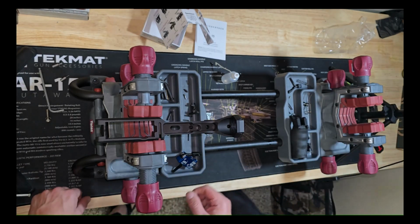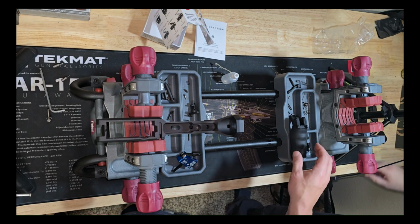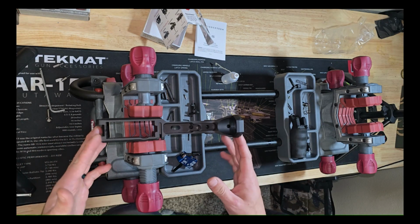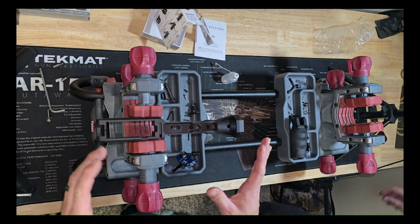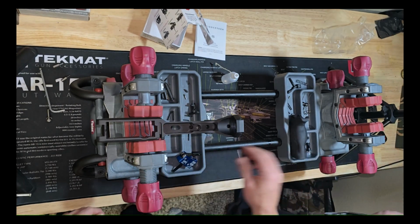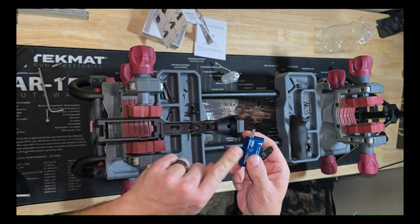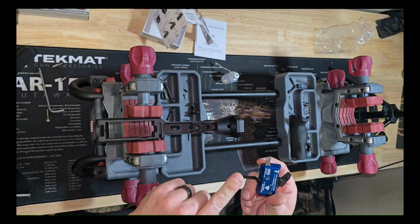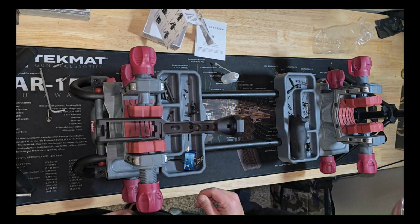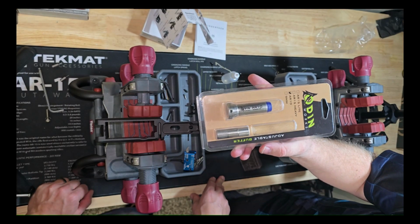We're going to be assembling an AR10 Lower. To show you the parts we're working with, we have an Aero Precision Stag Arms AR10 Lower stripped. We have an Ergo ambidextrous grip we're going to be installing today. We have a Trigger Tech Diamond straight trigger. It's a 1.5 to 4.5 pound pull. Yes, we did confirm that the AR-15 trigger does cross over to the AR-10 platform. What we're not installing today is an Odinworks AR10 adjustable buffer.